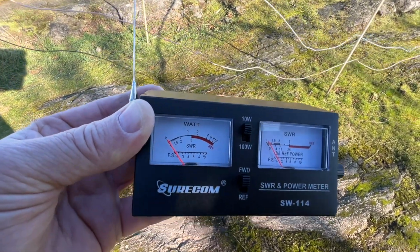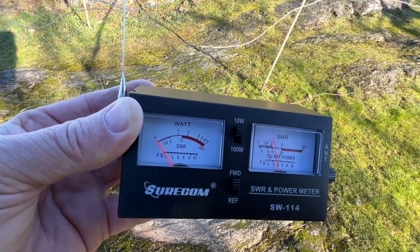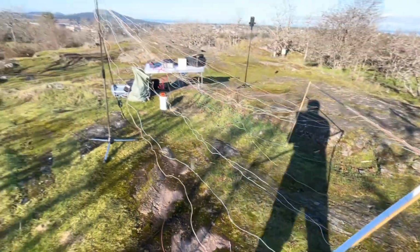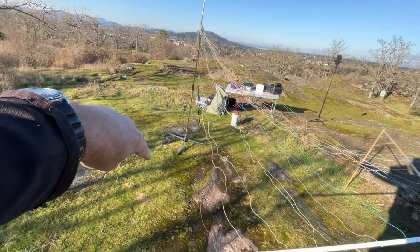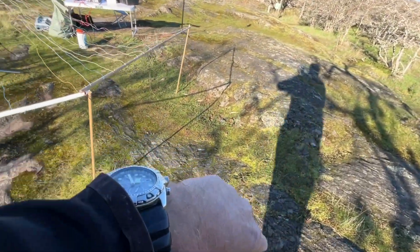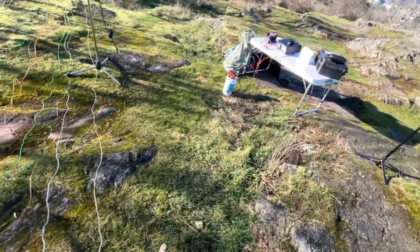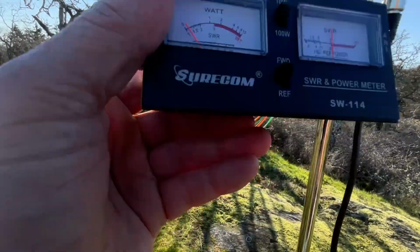All right, so here we go. I'm only about 6 inches away. We're walking down towards the end right here. You can see it start to pick up. Look at that, guys. There you go. So based on that, we're getting a pattern. There's the end wire. We're getting a pattern that goes like this. The main directionality is right in the middle, and then it comes back in and hugs around the other side.